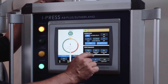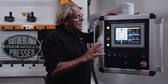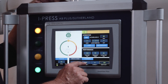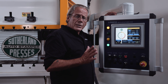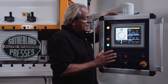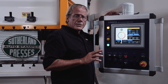The performance box is all for clutch-brake related, so it's monitoring brake stopping time and clutch engagement time. There are six counters on the press. We're showing one up front which is a preset or batch counter, and that'll run up to the desired amount of parts and then stop after that amount has been hit.